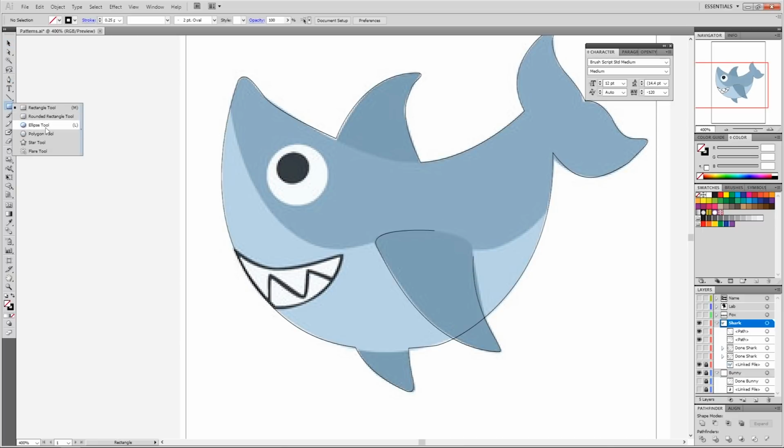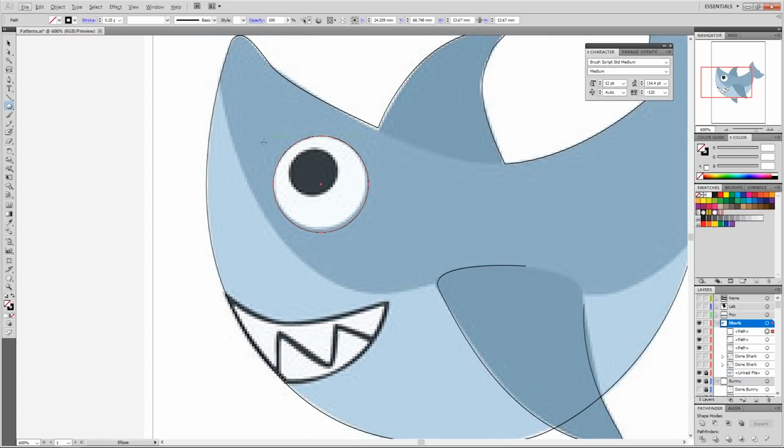As for the eye, I'm going to make it about the same size for now. But you'll notice this is a floating piece, and that's impossible to have in one piece of metal. So what I'm going to do is make another circle and place it up here like so. And then just take this away so I have a copy of it, and merge these two together so it only leaves the inner part of the eye, and then just put this back over here. So with that said, it's this size for now, but this is going to get scaled way down, so I'll come back and change the size of the eye because it's going to be way too small.